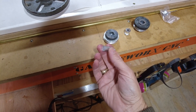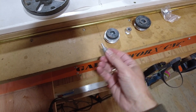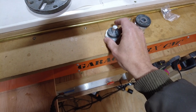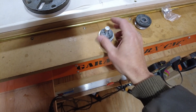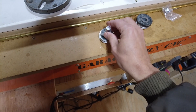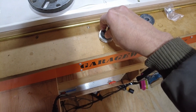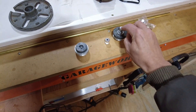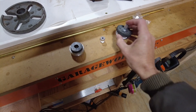In order to do that, I just turned down some aluminum here, put that in there, and then while I was epoxying this up, it kept everything nice and trued up. This fits in this one and it fits in this one as well — that kept everything really, really tight.